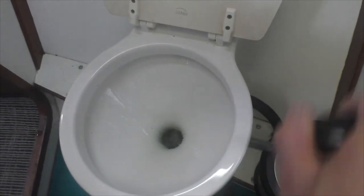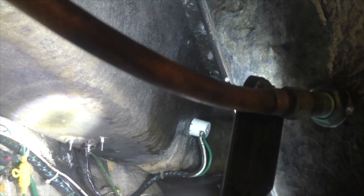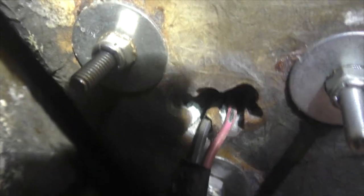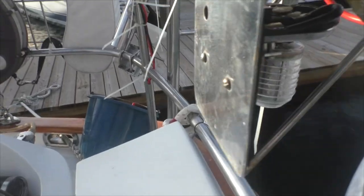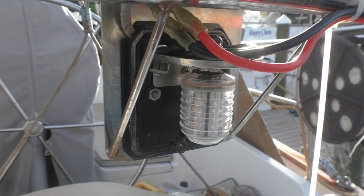There are no leaks. How are you doing, Doug? I'm doing wonderful, never had so much fun. This may not even be the spot where it's bad, but you can see the picture — it's not burned, it looks bare. This is the wire coming down from the stern light. You can see that red wire has a spot on it right there where it doesn't have insulation, and it's got a short back this way somewhere. The wire has been fished up the inside of the stanchion over there. Now we just wait to see if it comes on — okay, it's on!